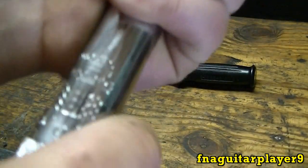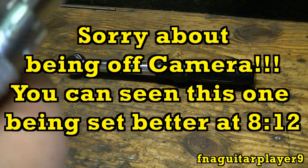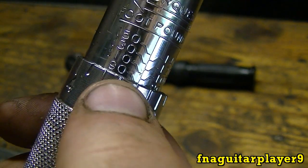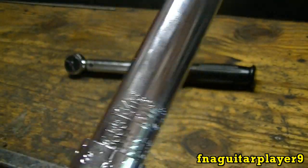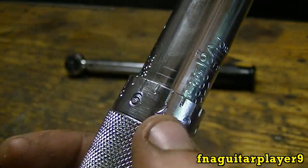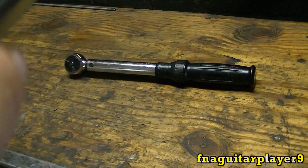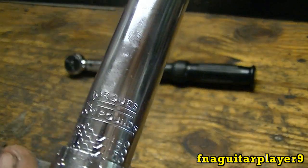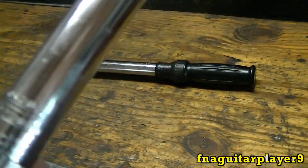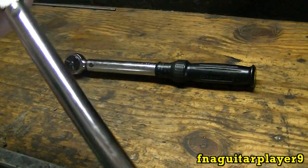This one's measured in foot-pounds; on the back you've got a metric scale but I just use foot or inch-pounds. It's the same setup — you've got different zero marks here. Right now it would be set at 90 foot-pounds, because it's closest to that mark. You turn this all the way over to the second zero and now it's set at 100 pounds. These go in two-mark increments all the way around, so going around again gets you up to 110 foot-pounds. Once you get your torque set, you lock it so you can't turn this, and you're ready to torque something down.